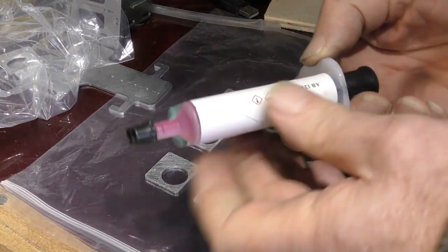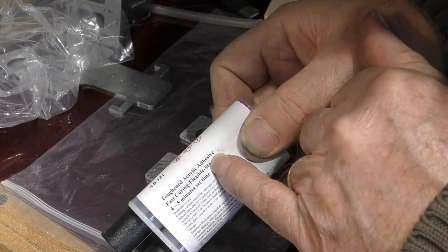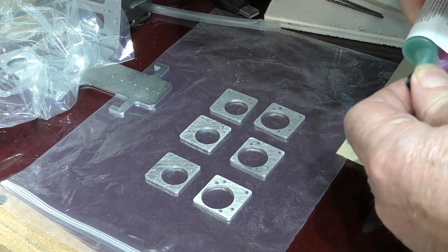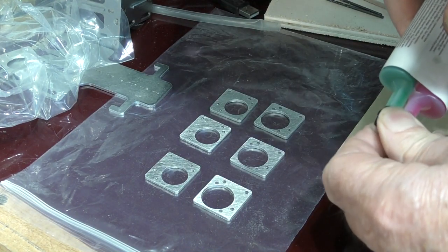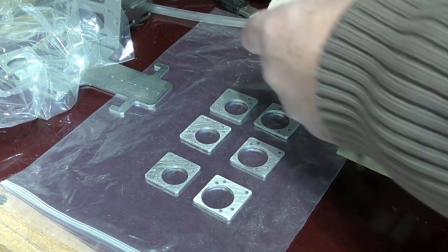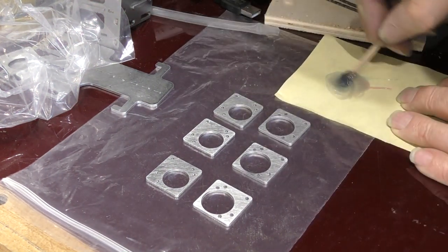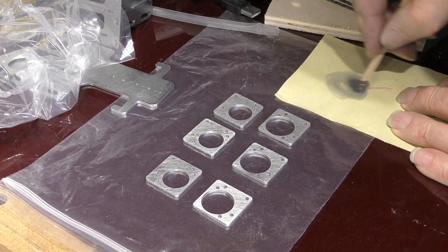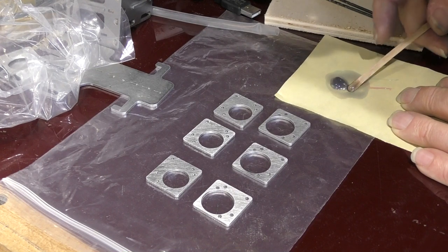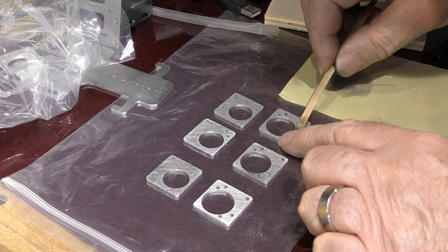So first of all, I've got some very tough toughened acrylic adhesive, but it's capable of bonding all sorts of metals together, and it's very good. So I tend not to use epoxy, but there is no reason why we couldn't stick these pieces together with epoxy resin. We don't need much of this stuff because we're not going to put huge amounts on it. Got about 5 minutes before this goes off, so we've got a little bit of time, and it's very runny and stringy to start with, and then it will start to get a bit harder.